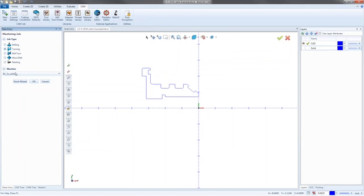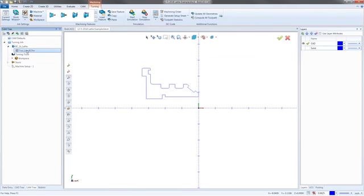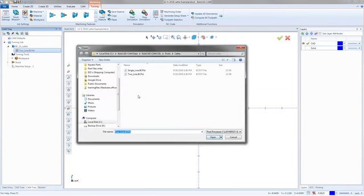The most important thing here is when I hit OK, the post processor. We're not sending out a bunch of post processors for version 31. If you look inside the folders when you first install, there's only 2 post processors that come with BobCAD for turning, specifically turning. There's going to be more for the milling, but we stopped giving posts, standard kind of. We stopped standardizing our library just because things are getting tweaked too much, and it's tough to keep up with some of the changes some of these companies are making.